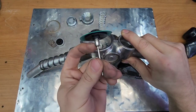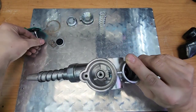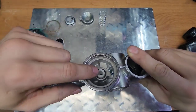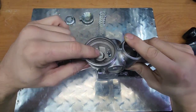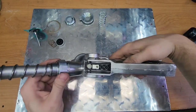When that lifts up, this chunk of steel here lifts up out of this recess. Inside that recess are 3 small holes that those 3 ball bearings live inside of. Whenever the piston is down, those ball bearings get pushed out, kind of like the weight on a weight set for a gym, and it keeps this from moving down. Why is that important? Well, that is the lower pivot for the handle.